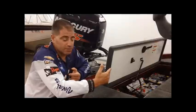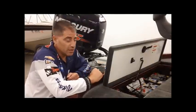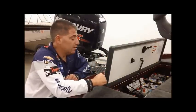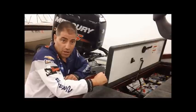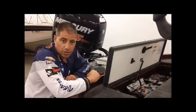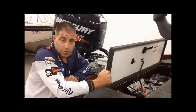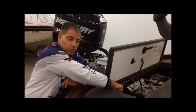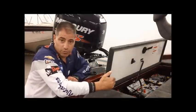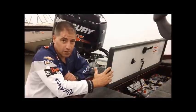Now, I have seen it happen a couple times, especially if you go to tournaments like up at Lake Erie and you stay in one spot all day and you run your live wells on, not on auto all day, on, full bore all day. And that's what you have to do to keep 20, 25 pounds of fish alive, is run them on full all day, okay? That starting battery will get drained so low that even with a set of jumper cables or even with the jump switch, it will not start your motor. So at that point in time, you flip it to battery two only. And at that time, it will start your motor off of one of your trolling motor batteries. At no time does that motor see anything more than 12 volts. Everything's hooked in parallel, okay?